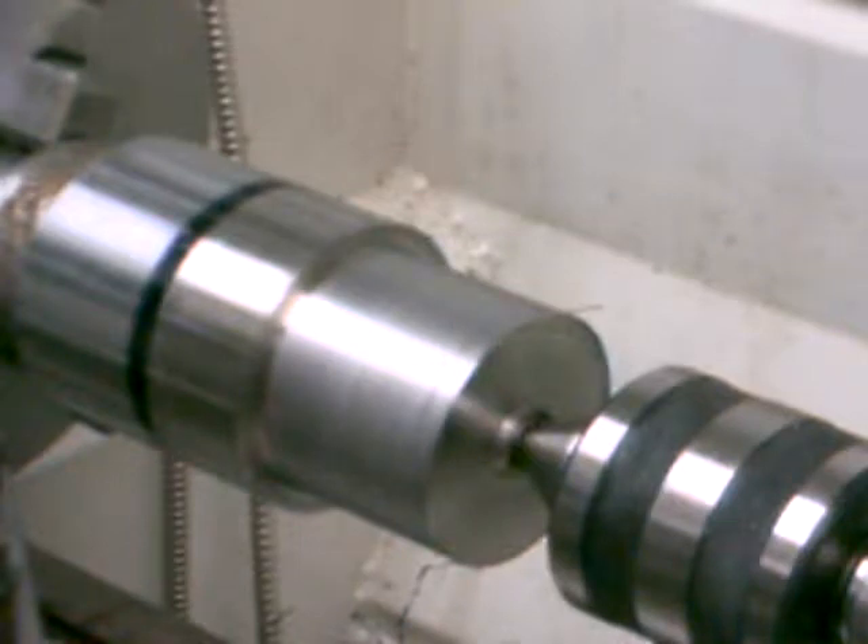I don't know for sure what it is. I know it's a lot harder than 12L14, so I think it's probably some 4130 or 4140. I don't really know for sure — I picked it up in a scrap yard, got it very inexpensively. I picked up quite a few different pieces of scrap material. This is some fairly hard material; I think it will work good for this outboard spider collar. Let me move the camera around to the outboard end of the spindle and we'll take a look at where this is going to end up mounting.